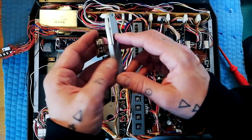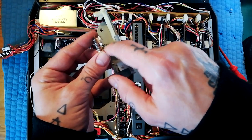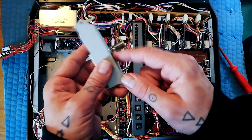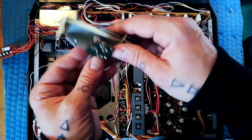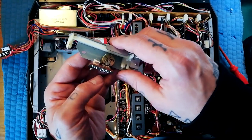If you don't have that facility then I would advise not to move this, though you could still put some contact cleaner in case there's some grit or something in there. You can do the usual procedure. You can see there's actually an access point just at the top there — you can squirt that in, move around, blow the contact cleaner out and lubricate it.